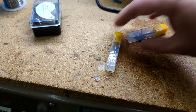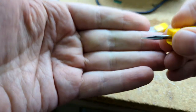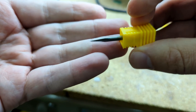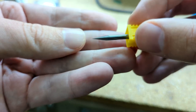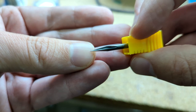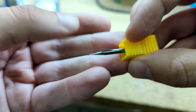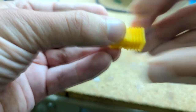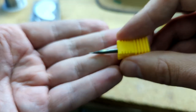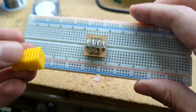These are the ones I would recommend for beginning and general use. You can see it actually has a flute and a cutting edge, which is great. It's 20 degrees. The tip — although they say it's 0.1mm, I'd say it's more like 0.25 to 0.3mm. It's definitely a wider cutting blade but this also makes it more robust. Normally I would go with the expensive ones, but for the purpose of this video I'm going to go with this one because it works fine for this particular project.